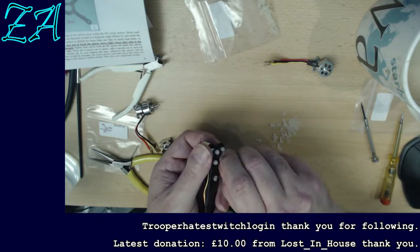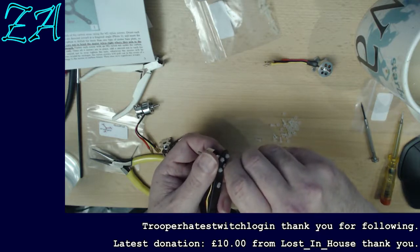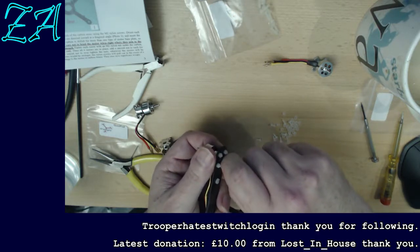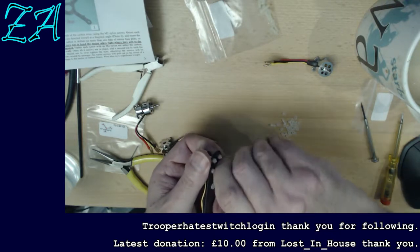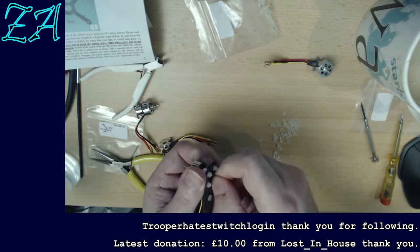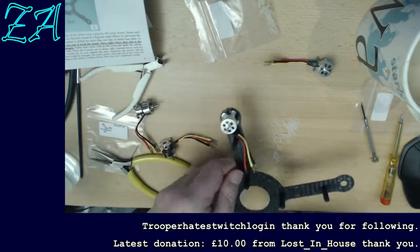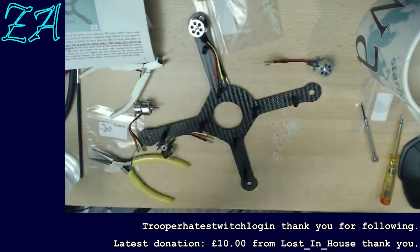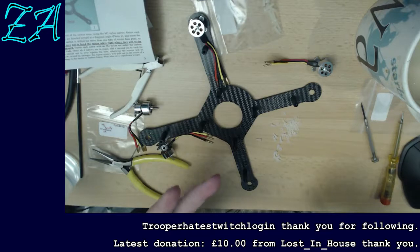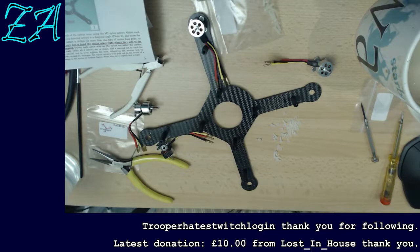When I first plugged the analog to digital converter in, Windows refused to tell me there was a microphone there. It took me an awful long time to realise it didn't know it was a microphone. It was a line in connector, which of course is what it actually is, but it was about 20 minutes before it suddenly clicked. Because if you plug a USB mic in, it knows it's a microphone because the USB device says it's a microphone. But with an analog to digital converter, it's just a sound source.